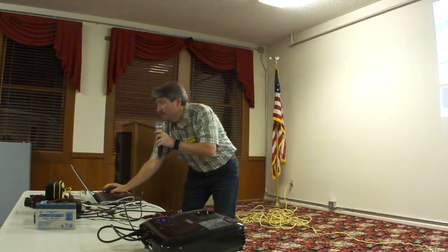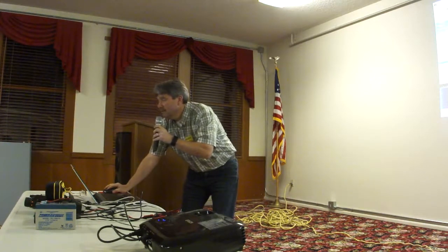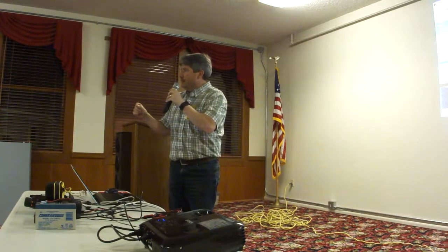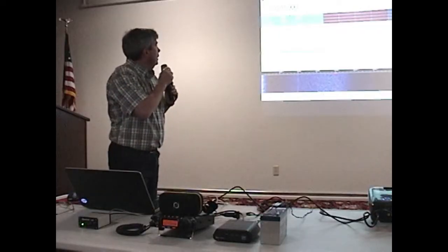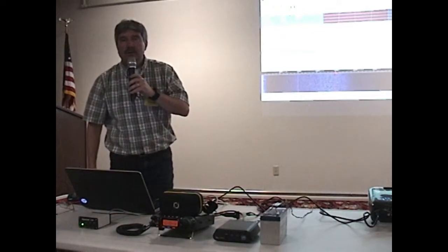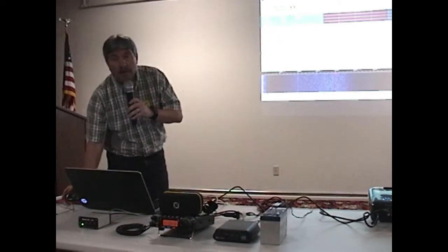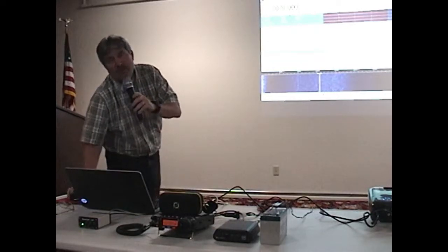Do you do CAT mode with your laptop, or is it all manual? No, I do CAT. I normally use it through the logging software, and I use that CAT connection. It's more stable than the FLDigi CAT connection for some reason. I don't know why. So the reason we flipped might have been something with FLDigi. When you click on the waterfall for frequency, does that change the rig? It should not, no. But let me do that and just see what happens. Did it change it? It shouldn't change it, no.